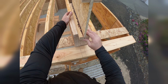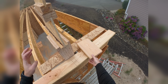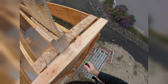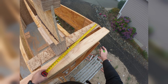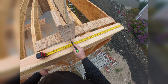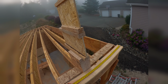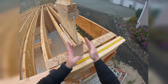If I shift that off. If I'm very careful. Ooh, look at that. Okay. So pulling from the outside, that allows our sheet to fully cover. We don't want it to split. We want it to fully cover. So 32 is center. I offset each way for my stud thickness. If I had a 5 1/4, there's center. If I have this joist, there's center. Smaller joist center. Smaller joist center. So, hopefully that makes sense. Centers stay the same, sides offset based on thickness.